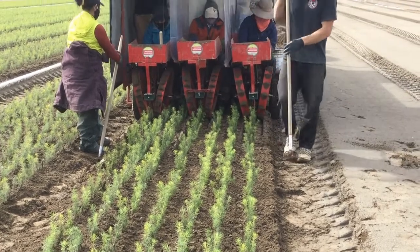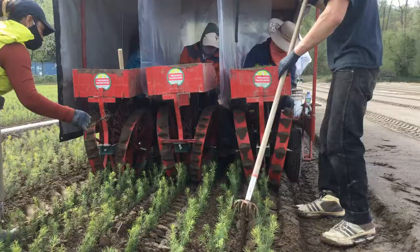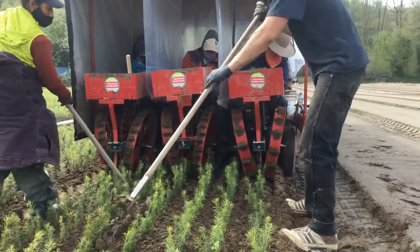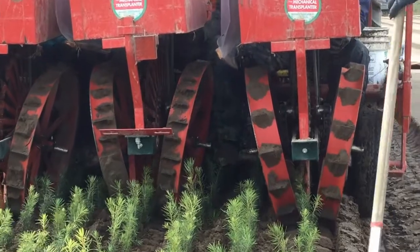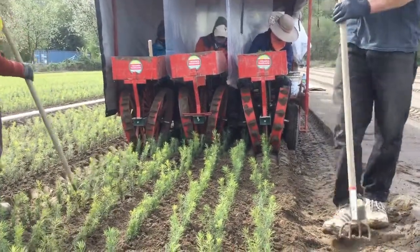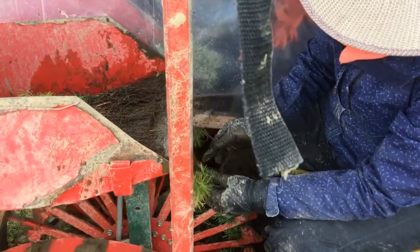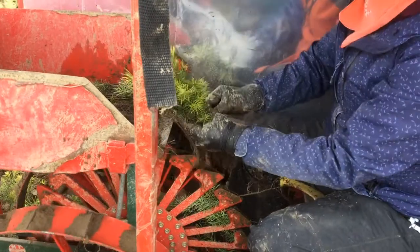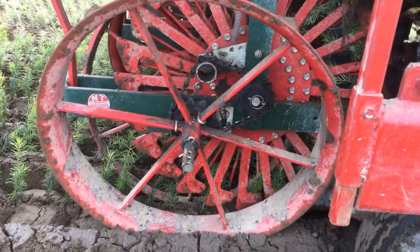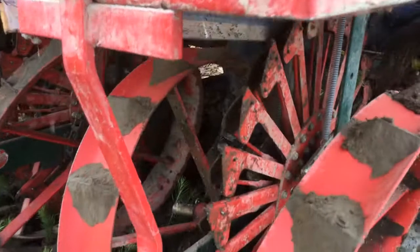As we catch up to the crew and tractor planting, you can see there are seven rows per bed. Each row is planted by an individual planting wheel or station, and each one is manned by a separate person — you can only see three here but there are seven people in there. Each station has a completely vertical wheel in which they're hand-feeding seedlings that will be pressed into the ground. There is a blade that opens up the ground, the wheel comes down and sticks the seedling in, and then there are two more wheels angled in that press the soil back around the trees. Here you can see one of the ladies feeding the wheel as it goes around — each seedling will be about three inches apart in this row.